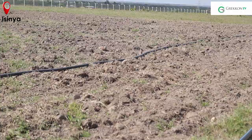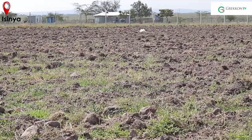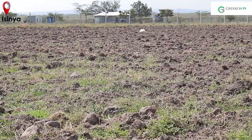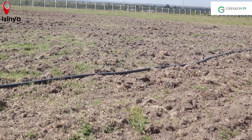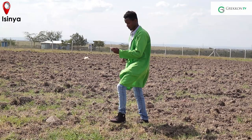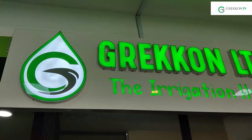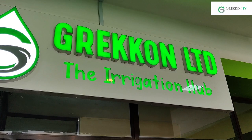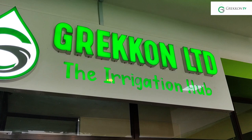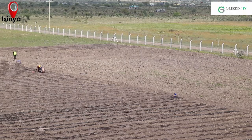Before any installation, it's advisable to do a site survey — this is an important part of the project. It ensures our technicians get accurate data for planning. During a site survey, we assess your farm by measuring the slope gradient, assessing soil type, and providing recommendations on which irrigation system will suit your farm depending on the crop to be planted. We also do farm measurements using GPS gadgets for both small and large scale farms, confirming measurements with a tape measure.